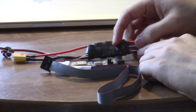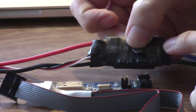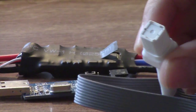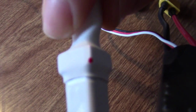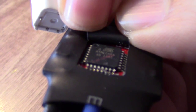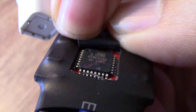The pins on the chip are very small. You can build your own tool to contact particular pins on the Atmel chip, but for ten dollars you can get a ready-made cable with specific pins that will contact the correct pins on the Atmel chip — this way we don't have to worry about damaging or cross-circuiting anything. When using this programming socket tool, notice the little dot on the corner. It's very important that when aligned with the chip, this dot corresponds with the dot on the corner of the chip, so the correct pins are contacting.